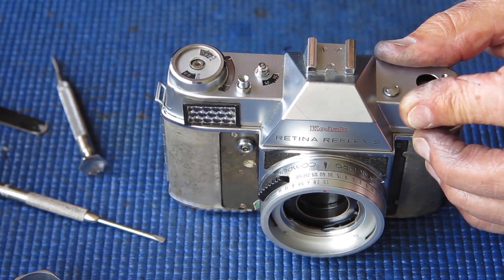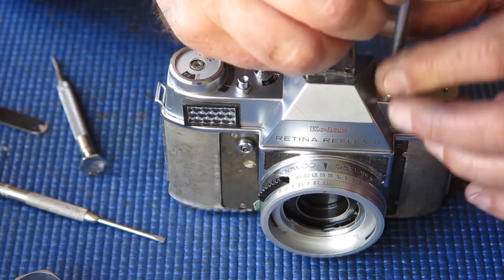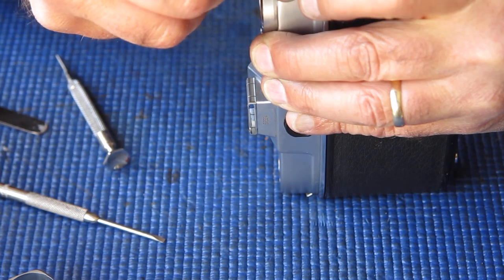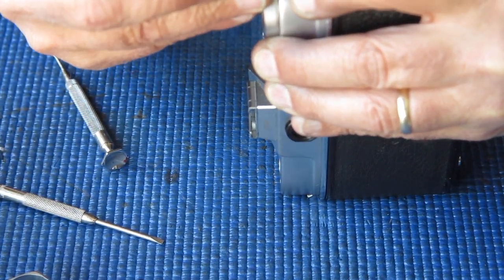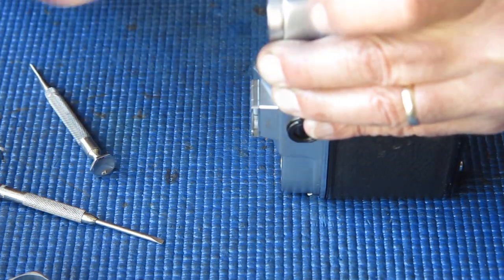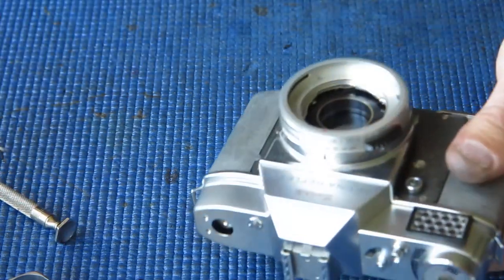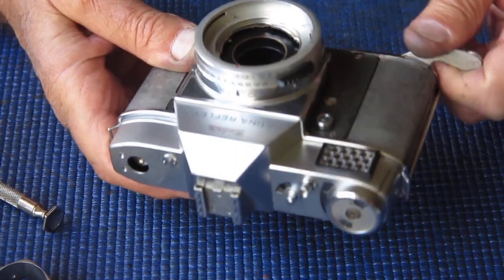Don't bother putting the leatherettes back on the camera until you've got everything else done and you're certain that everything works correctly, because it's very frustrating if you put the leatherettes back and then decide, well, actually you need to get back into the shutter because perhaps the flash contact is not working correctly or something of that nature. Or indeed that the flash shutter stops working altogether because some spring has got too tired and decided to flag